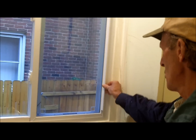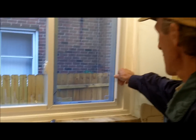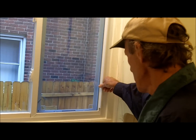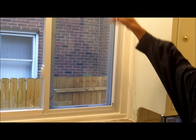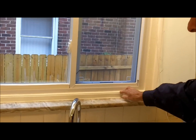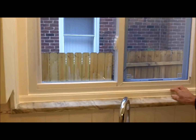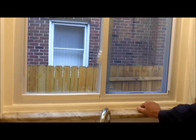So start with the problem. What was the problem first, George? The problem was I have an old existing opening and they don't make a window to fit it without going to something custom, which is extremely expensive. So I picked a stock window, and what I ended up doing was just reframing. I added a 2x4 on each side, 3 2x4s on top, redid the trim on the inside, redid the trim on the outside, and then caulked everything in and painted it. So I have a nice tight-fitting, waterproof vinyl window that the owners can get some nice use out of because it's insulated, keeps them warm.